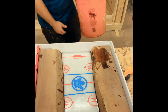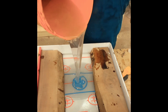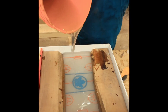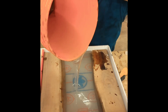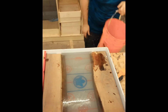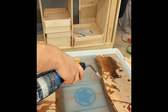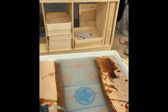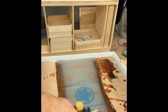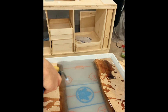Now it's time to pour our epoxy. I've mixed up a couple of liters of the Slowcast Rusty Design Epoxy and I'm just going to pour it on clear with no tint or dye. I've mixed up a bit extra because I've got a second project I'm pouring into. Then we use our torch again to pop all the bubbles. I'll do this once, then wait about a half hour and come back. With this Slowcast, you generally don't have to come back again — these will mostly pop by themselves.